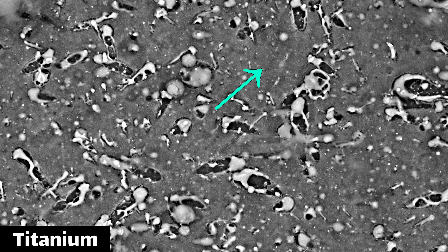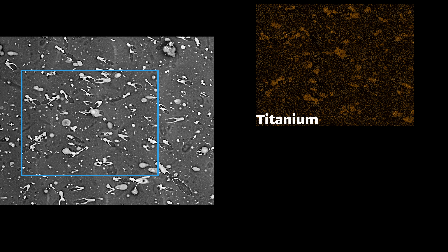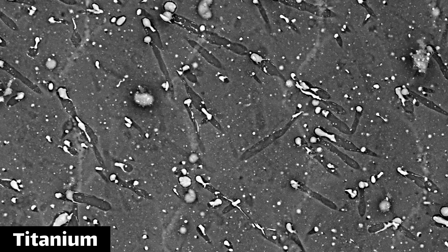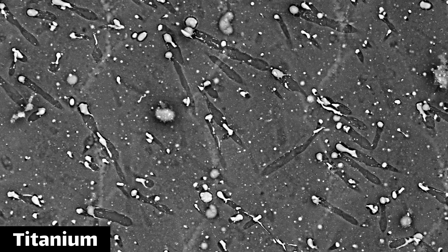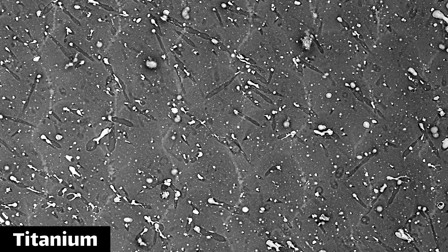The two exceptions are titanium and Invar. The titanium samples show a foggy, diffuse background with comet streaks where molten droplets appear to have rolled across the surface. Using the element detector, we can see a faint background of titanium everywhere — not just on the comet streaks — along with a lot of oxygen, suggesting titanium dioxide. My theory is that titanium is ablated upward and rapidly converted into a cloud of TiO2 that coats the surface, with only large enough molten drops making it through to leave behind comet streaks. We only see this with titanium, not the other metals.